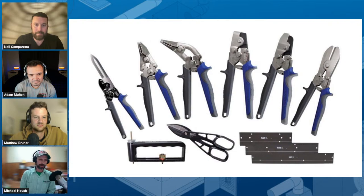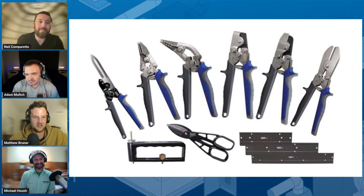Folding bars are also like the most useful. The only sheet metal fabrication we'd typically do is a plenum for a unit. My background: we'd use a duct knife and just pliers instead of duck bills — no break, nothing. Instead of crimpers I used needle-nose pliers to make a bend. I slowly added tools over time — when I started out it's just the cost. Anything's like $75 each now; it's crazy.